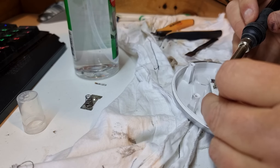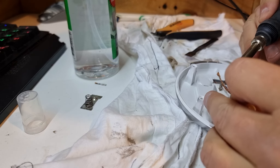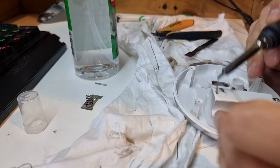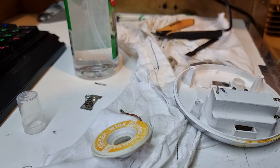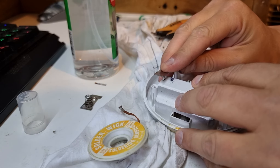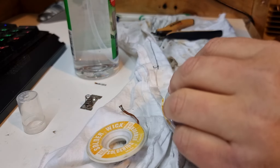To remove this contact, we've folded this tab vertically and we need to get some of that solder off. I have some solder wick — I'm first going to attach a bit of fresh solder on here, which gets some flux in there, and then we're going to solder wick our way out.